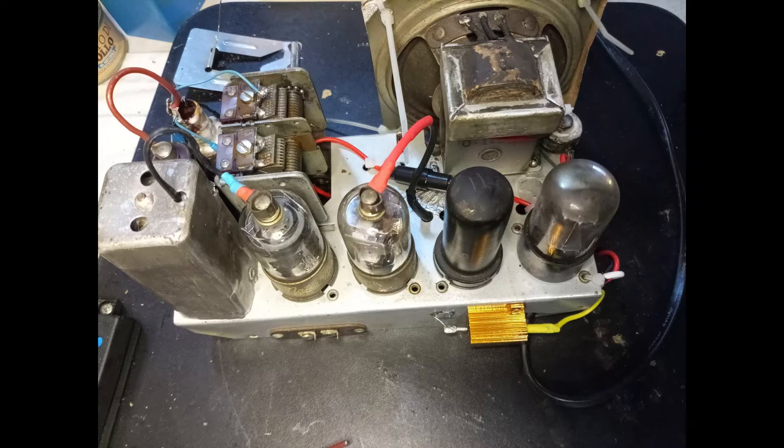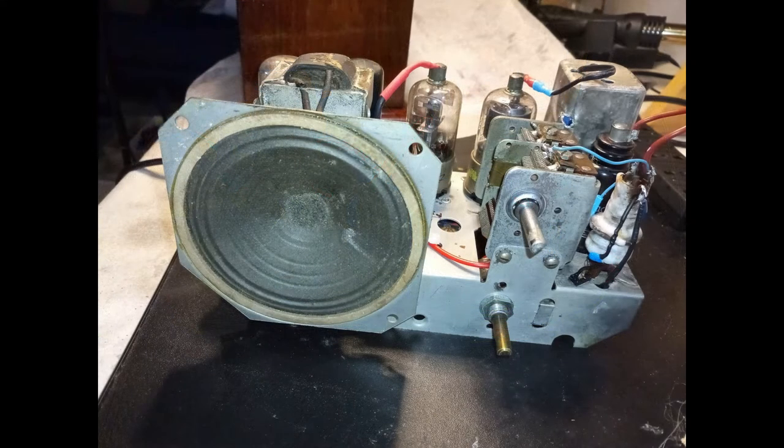The antenna can no longer be connected to the mains, as that would only bring useless noise. Like in any other superheterodyne radio, the intermediate frequency transformers must be tuned to the proper frequency. For this particular model, the frequency is 465 kHz.